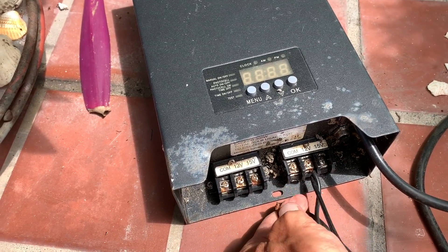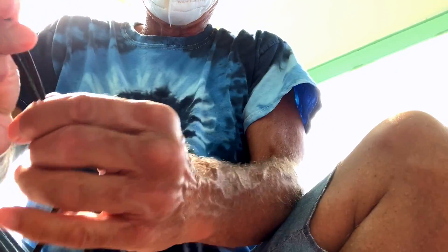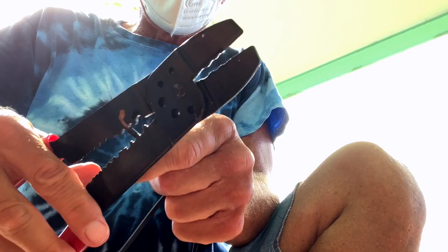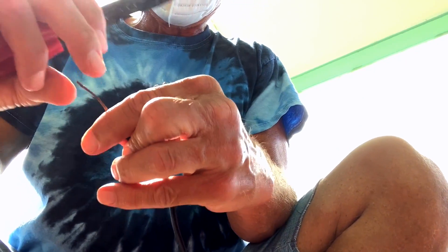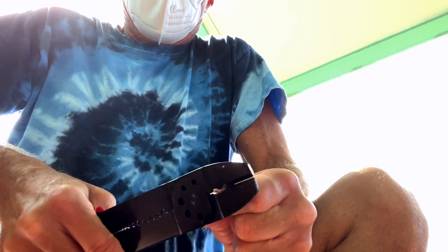I'm just going to pull these out and pull them apart. So now I've pulled them both off. These ones here were off the 12-volt side, so I want to pull those over here. I'm going to tie these in a little knot — that's going to let me know they go on the right side. These here are going to be the left side. I want to clean them a little bit, so I'm going to get them in here and clean with these wire cutters. Now we've got a nice clean line. You want to do that to all of them. Twist it and pop it — there we go. So these two are clean now, these are the COM lines.